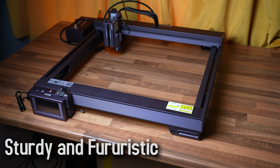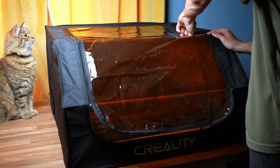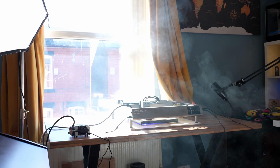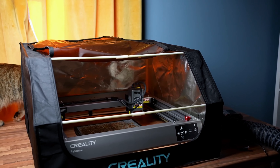For its cost, this machine is definitely a reasonable option — I found the best prices and put them in the links in the description below. I highly suggest you get an enclosure box if you're using any laser engravers stronger than 5 watts, at least if you don't want your neighbors to think you're high all the time. This is how the room looks with only a window open for ventilation, and this is the same project with an enclosure box. I used a Creality enclosure box, but anything with a fan in it will get the job done. If you have any questions, drop them in the comments below — I'll try to get to them, and have a nice day.